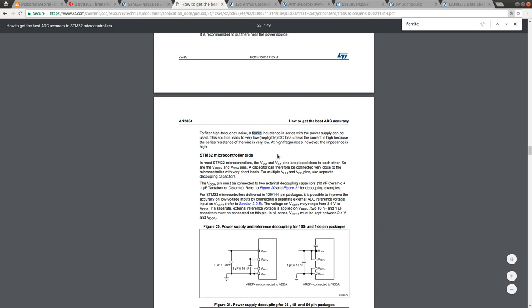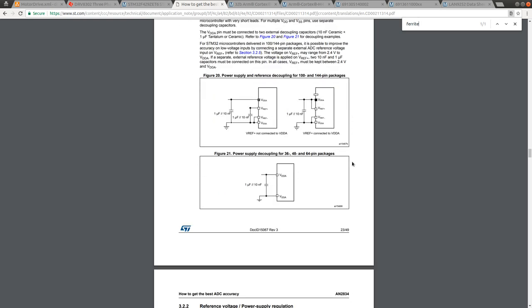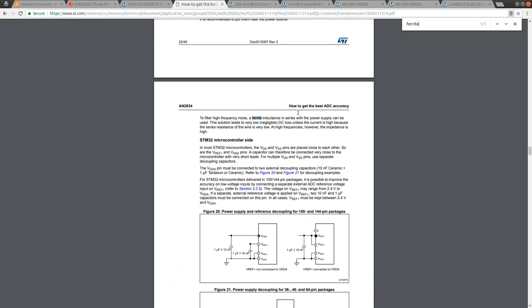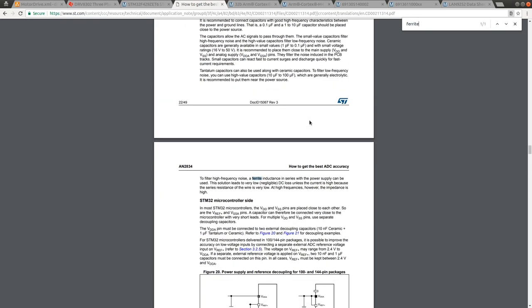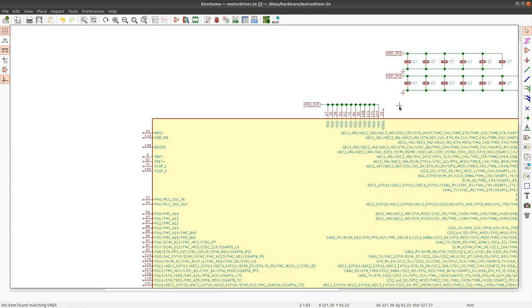The question here is what would be the high switching frequency. We're going to have a lot of switching going on at maybe 40 kHz, which is not really high frequency - for me high frequency is above 1 MHz. We could technically put a ferrite bead plus a few capacitors and a larger electrolytic capacitor, but I'll research this portion of the schematic to make sure I come up with the best possible solution, not just something I've used before. I still want to research this a bit more so I'll leave it for now.